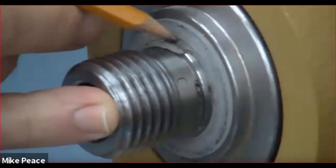Here's that mangled washer. I was doing this demonstration for Gwinnett in a guy's shop, and he happened to have one of these washers. I'd heard these washers are supposed to be real good, that the chuck will never lock up. And then I've heard other people say, yeah, but they're not machined like metal, so they can tend to introduce a little vibration. Here's an example where in his use, he mangled this thing from normal use. It squeezed that plastic and it's got this shard sticking out. I guarantee you that a chuck run against this thing will not run perfectly true. There's going to be some vibration or tiny runout because this washer is not steel. And it's just so much better to use a little bit of WD-40.